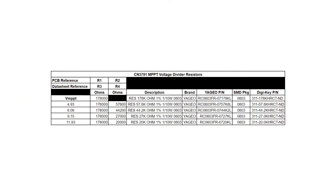In case you want to adjust the input voltage of your CN3791 board, here's a table that shows the values of R2 needed for 12, 9, 6, and 5-volt panels. I have also included the DigiKey part number for each resistor value. Note that in every case, R1 remains at 178,000 ohms. The high resistance values for R1 and R2 ensure a low current drain through the voltage divider.